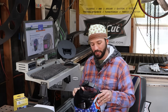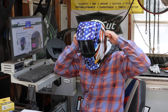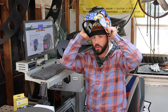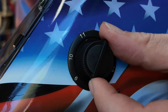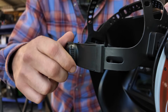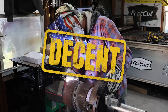The headgear really isn't as bad as I thought it would be — two points of contact for adjustability, and my eyes still line up where they should. The nuts tightened down really tight and didn't strip, which is a good sign. Still a little wobbly even when fully tightened, but you don't want them that tight anyway. On the inside you've got sensitivity and delay adjustments, and your adjustable shade from 9 to 13 with a grind mode. All intents and purposes this hood should be pretty solid — but when I crank down on the back headgear, it just strips. I'd be curious how long that piece lasts with regular use. We'll use this in the welding portion to see how it looks through the hood.